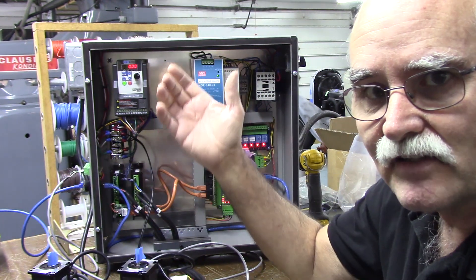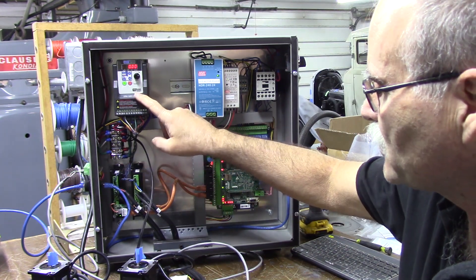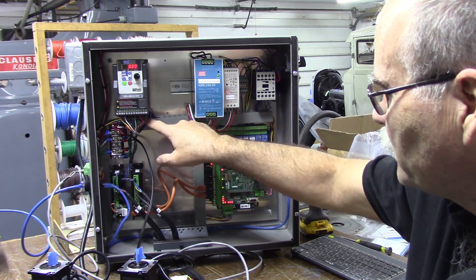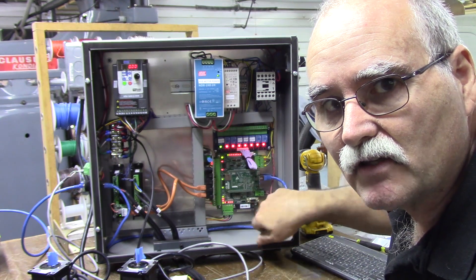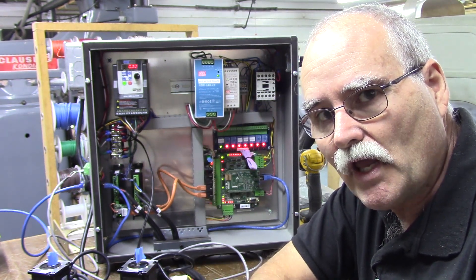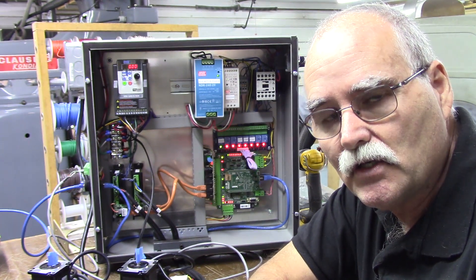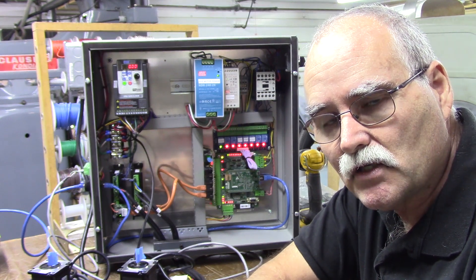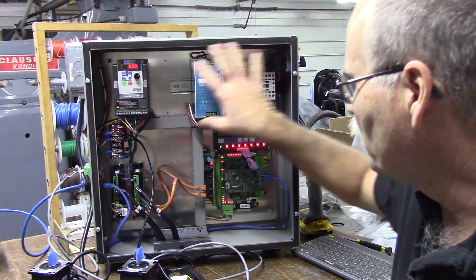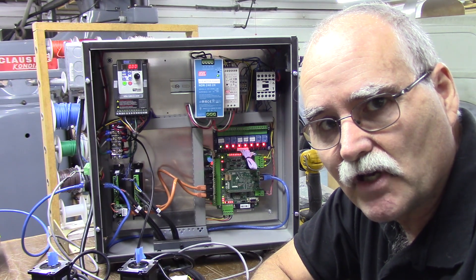He can disconnect it — he can disconnect his motors from the drives, disconnect the motor cable from the VFD (I'll tag them T1, T2, and T3 so he can put them back on), disconnect the encoder from Acorn. So guys, that's it for this one. I will do a dry erase board exercise on basically wiring this cabinet — that will be a detailed video — and I'll go over the jumper settings on C86 and C34 and how this is all wired up. Until next time, take care, see you soon.